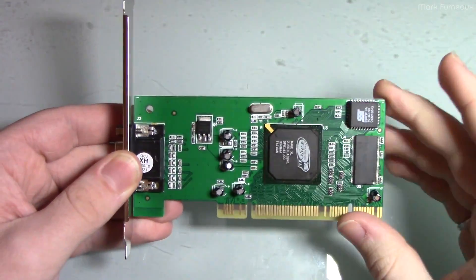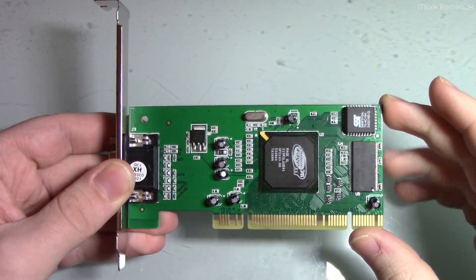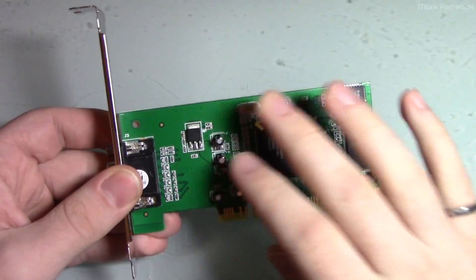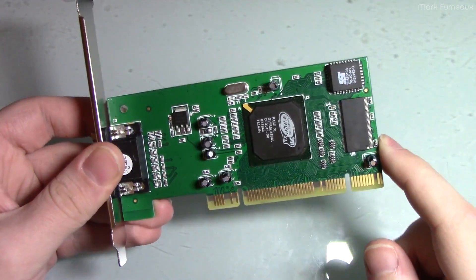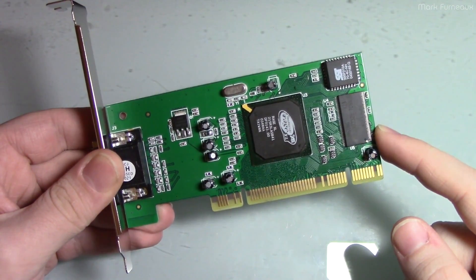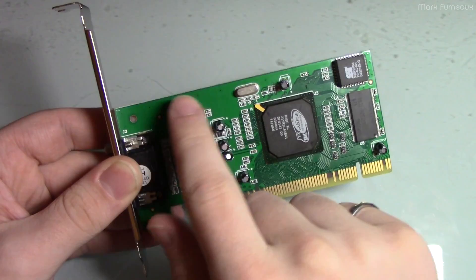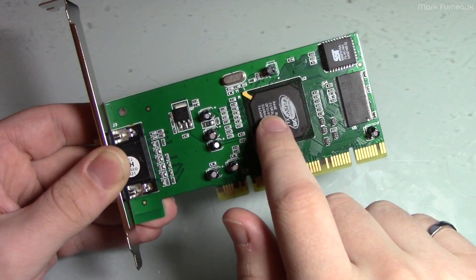And I discovered something — this is actually quite different. This PCB layout is not a copy of the original ATI card from when this was originally new. This is a very cost-reduced board with significantly less on it, and what I found out is that this card is 3.3 volts only. So if you put this card into a system with 5 volts, it will not run, because this transistor here is just being used as a series pass transistor — basically an LDO — connected to the 3.3 volt rail to derive the core and memory voltage.